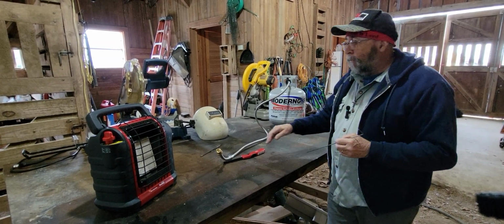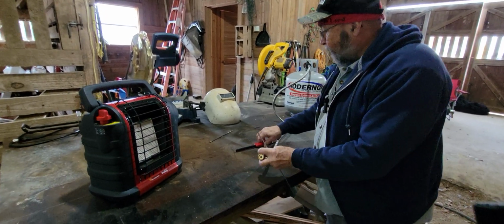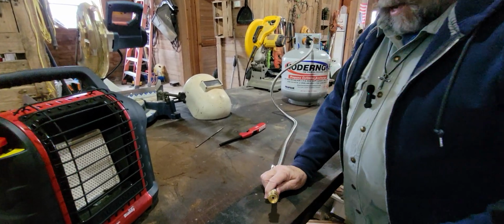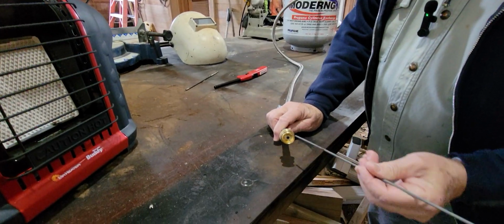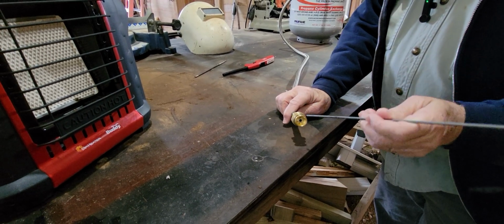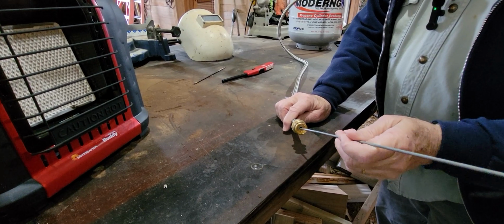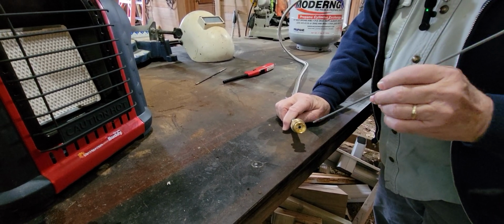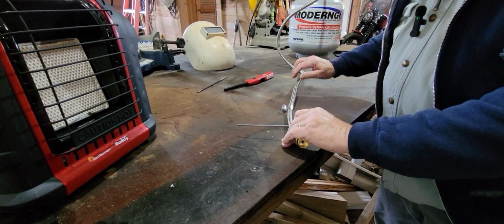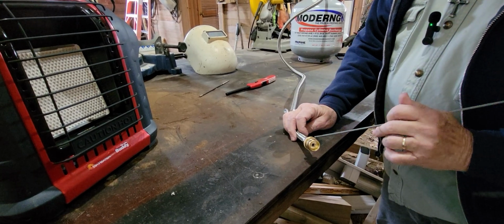Okay, and then you come over here. What I did to drain the oil out, because what you have in here is pressure now. This hose is pressurized, and there's a little check valve here that stops the flow from coming out. So because of the pressure, when I push this little check valve in, it will allow that pressure to equalize, or at least escape. What that will help to do is to push that oil that's laying in this system out through here.